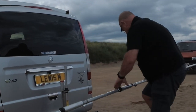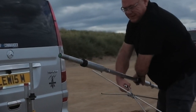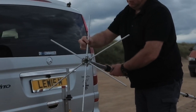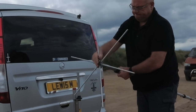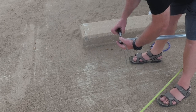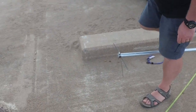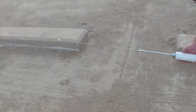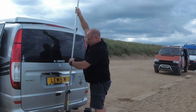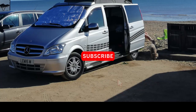All of the materials that Hustler have used are really good quality, and even though this antenna is probably maybe 10 or 15 years old, there's no signs of rust at all. This is the capacity hat that you may have seen me show before. Here we are putting on the little top capacity hat for 40 or 80 metres. And this is the top whip and loading coil for 80 metres — it just slots straight on. It is quite neat and quite easy to take down.